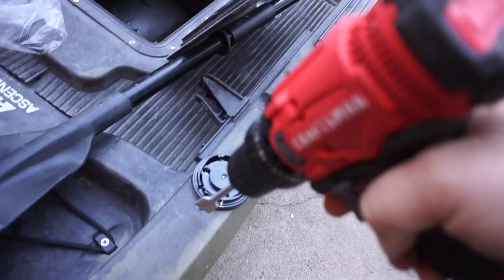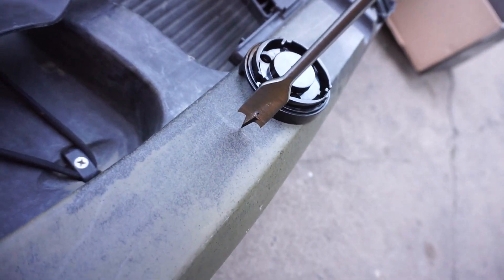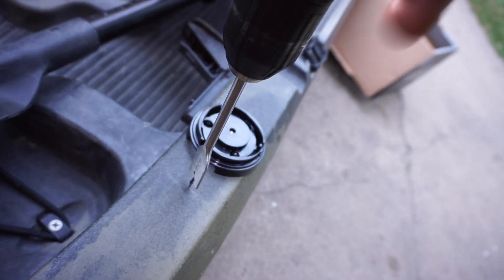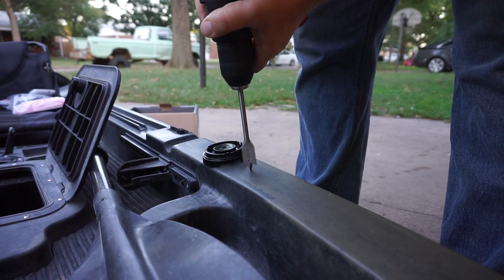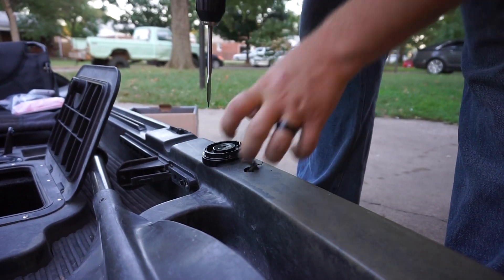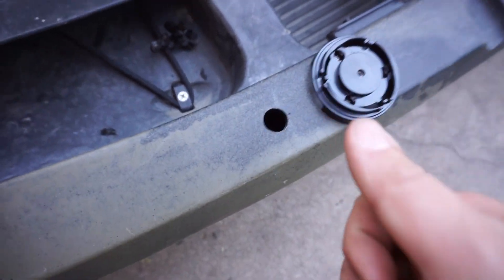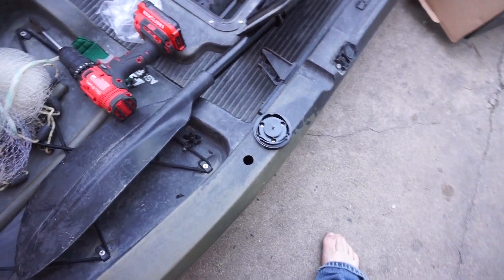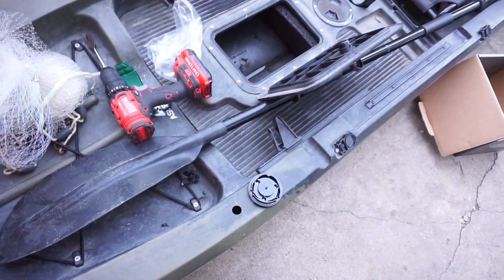For this one, we're just going to sink it right here behind here. This is a three-quarters of an inch hole bit, so we're going to go ahead and drill this out and run our wires through. We've got our big old hole here. Good thing we have some black RTV water-resistant stuff to fill that full of just so no extra water gets in the deck. Let's go ahead and run our power wire and transducer wire through there and get them set up from the back.